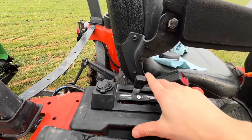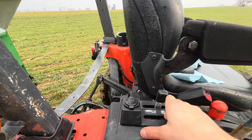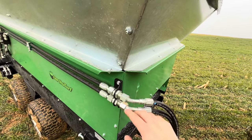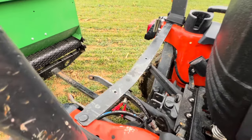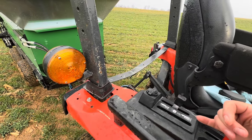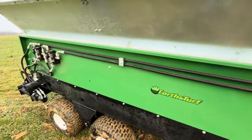We have hydraulic controls right here — one goes that way and one goes this way. The same thing goes either way depending on what you're looking for. If you go this way, it's going to cycle the fluid in this one and out this one. It depends on how they're hooked up. You can hook them up differently, so you've just got to figure out what works for yours. Some tractors only have one direction of flow, so you just have to work with that and make sure you hook them up in the right order for spreading.